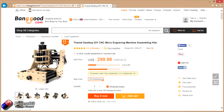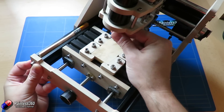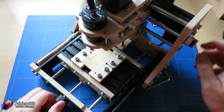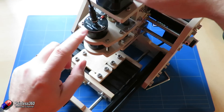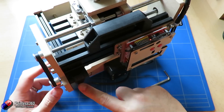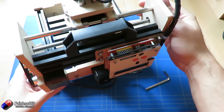The instructions that you get underneath that web page that we've just looked at are fantastic. The way it works is that in here we have a very sharp little engraving point, and we get a couple of them in the kit. What you do is you can move all three axes — this bottom bit goes backwards and forwards, the top goes side to side and it also goes down as well, and this motor runs. At the back we have all the stepper motors and we have the little Arduino set up here.